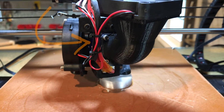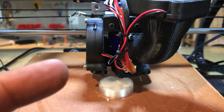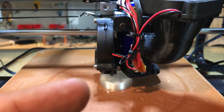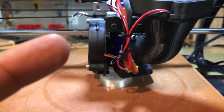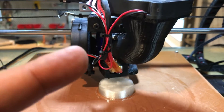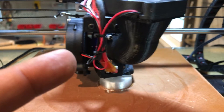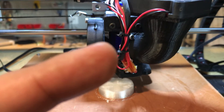The other piece we have right here is the hot end. I modified the hot end from direct drive to a Bowden E3D V6 knockoff — it's an all-metal hot end and it works great. A lot of people might say direct drive is better for flexible filament, and they may be right, but I've been printing this for years, highly successfully, and the all-metal is important. I also replaced what I think was a 20mm fan with a 40mm fan to really keep this cool, because it's critical to keep TPU cool in the cold part of the hot end. TPU is already very flexible and doesn't want to compress or retract very nicely, and the warmer it gets, the worse it's going to get. This does a really good job of stabilizing the plastic within the hot end element, so this is a critical component to the success of the system.